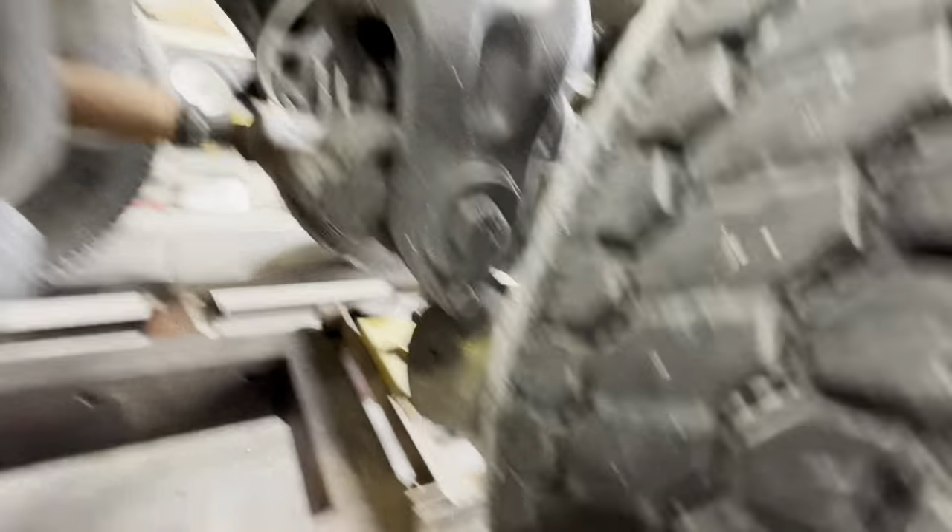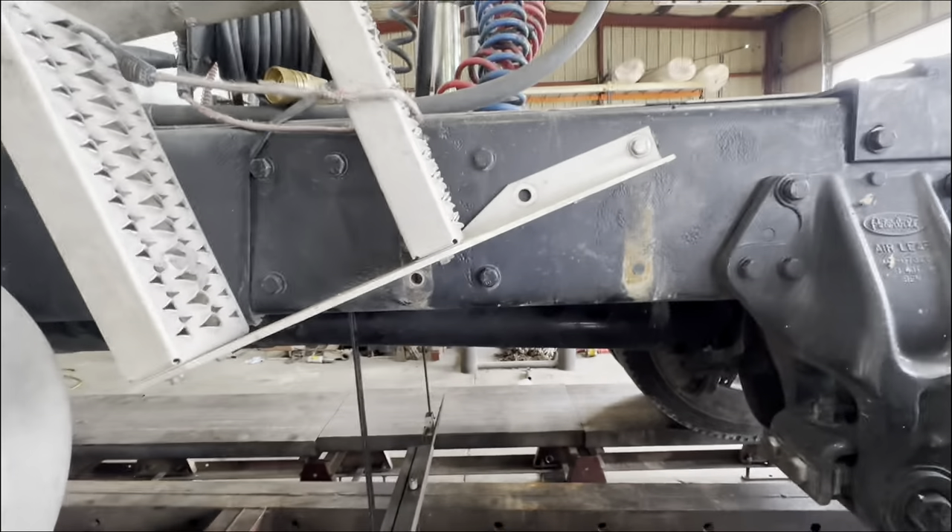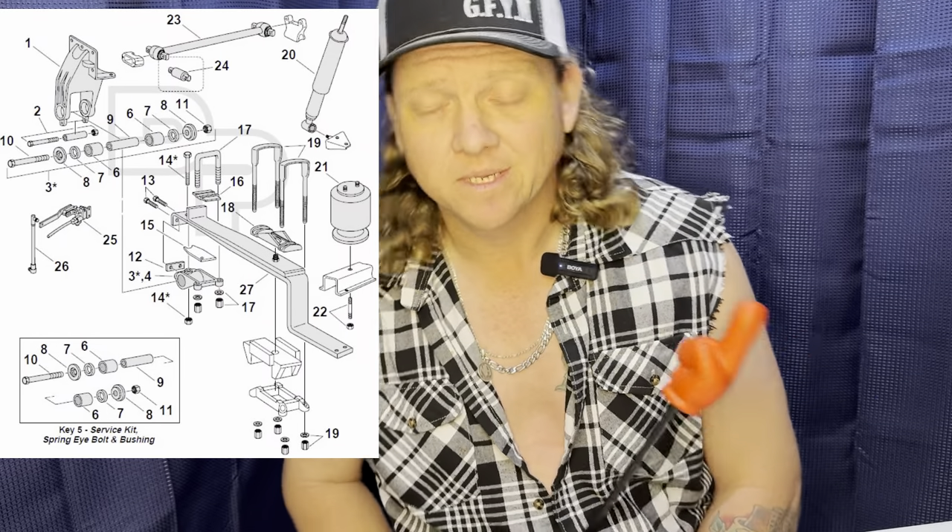The customer stated he had new bushings and everything looks good. Now the truck we're working on today has a low-leaf air suspension — yes, it's kind of a pain in the butt to loosen up all these parts to get it adjusted. But this system came out back in 1987, right around the same time the 379 came about. Before that there really wasn't much of an option for air suspension design. Peterbilt later came out with the air track system — it's a lot heavier and it's good for 46,000 pounds.